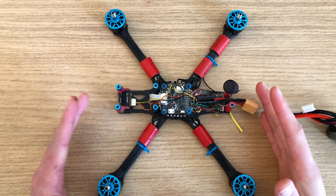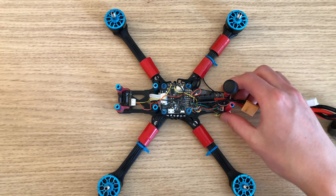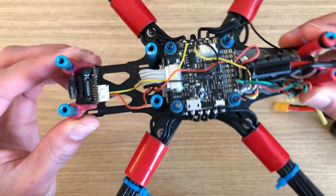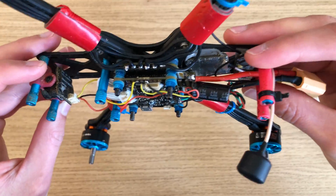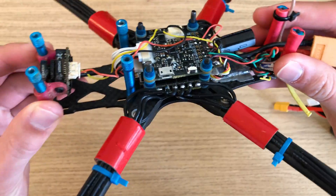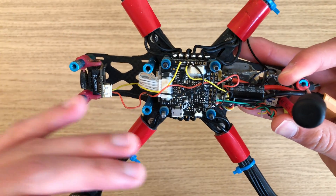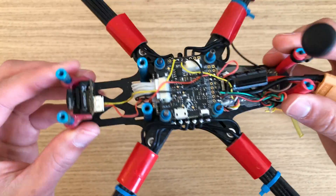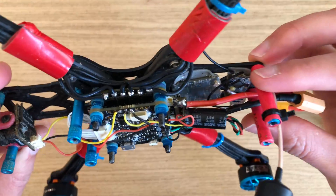When you're troubleshooting, you generally want to do the easiest thing first, and to me that's just looking at everything and seeing if there's something obviously wrong. If there's some kind of burn marks or something like that, that's a very obvious indicator that something's gone wrong. I'll also note that if something is fried, especially the ESCs, they like to take other things down with them, so you'd also want to check for that.